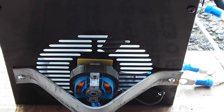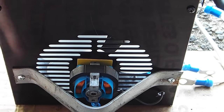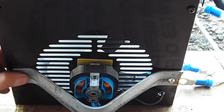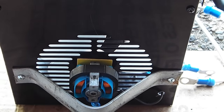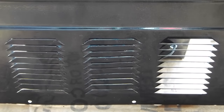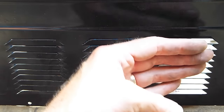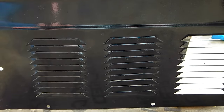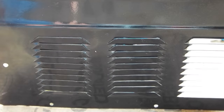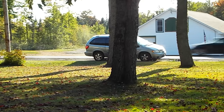While I'm waiting for the mailman to bring the new bridge rectifier, I want to show some other modifications. Besides putting the fan on the outside, I took a piece of angle steel, flattened it out, drilled holes in each end after bending them to fit, put bolts through, and now I've got a nice secure bracket to protect the back of the unit and the motor. I also flattened out the louvers near the fan — since the covers are backwards now, I flattened the back two louver panels and left the front open so air has to sweep past the main transformer before escaping out the front louvers.